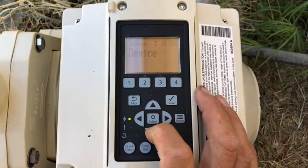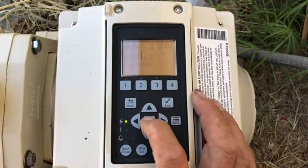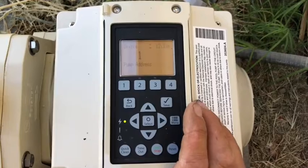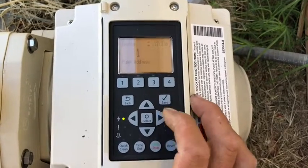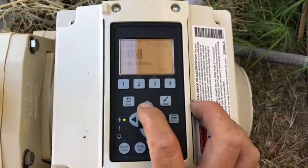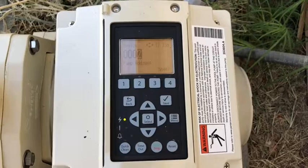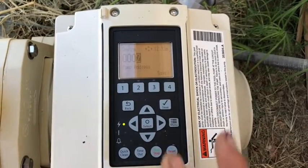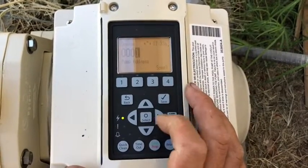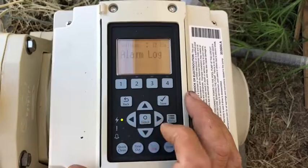Let's cruise through Settings. Under Device — say you had this thing programmed into an automation system with multiple pumps — you'd hit select here. By default it is always pump address one. If you have multiple pumps, you've got to change the device number. Your filter pump might be device one, a second pump would be designated device two. For all intents and purposes, if this is a standalone system like we have here, you don't need to mess with it. That setting is just so automation systems can tell different pumps apart.